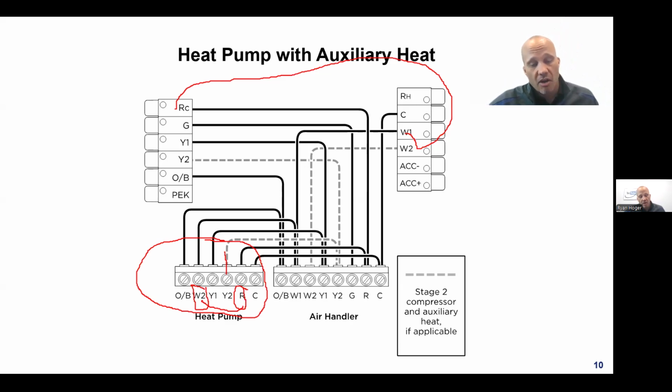So that is not often that you have that. Usually around here, meaning the Midwest, we typically have 2 wires outside, Y and C. And if it was a more modern, efficient system, we might have 3, Y1, Y2, and C. But we're never going to have 5 wires sitting there waiting for us. So we're going to have to run new wire.